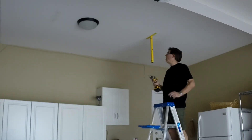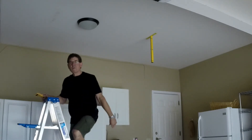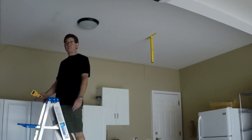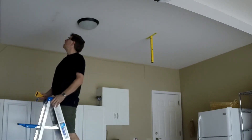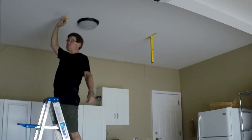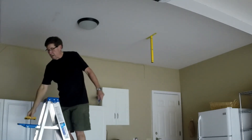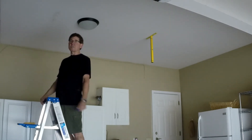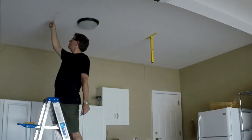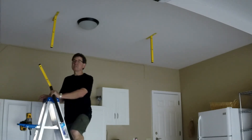It's now very easy to drill my remaining two quarter-inch holes as my ceiling post defines exactly where those holes should be. I next need to locate where I want to put the second ceiling post. The ideal spacing distance is on the order of 40% to 45% of the length of my boats or my SUPs. What one inevitably finds is it is not exactly what the spacing is for the joists, so find a joist that is close to where you want to be. Then repeat the previous steps: drilling your test holes, putting in your larger holes, putting the ceiling post on just at one end, finding the holes for the other end, repeating your test drills, and finally attaching it to the ceiling.